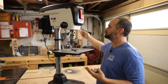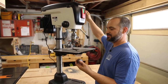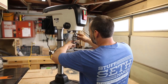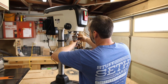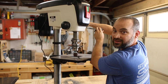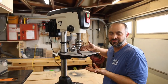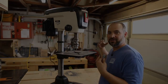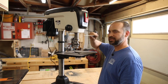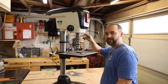Another cool feature is that you can lock the spindle in the downward position, which is useful for a couple of reasons. One is that if you don't have a spindle sander, you can use these little drum sanding bits in the chuck in place of a drill bit. You bring the spindle down to how far you want it, turn the locking ring all the way clockwise until it stops, and lock the spindle handle — now you've got a little spindle sander. The other reason to leave it in the down position is to remove the chuck, using the little wedge tool they provide; you'll see a slotted hole in the side and it goes right in there.